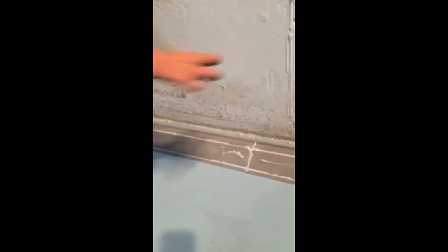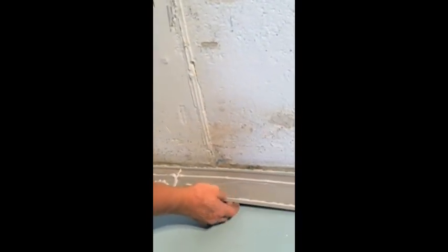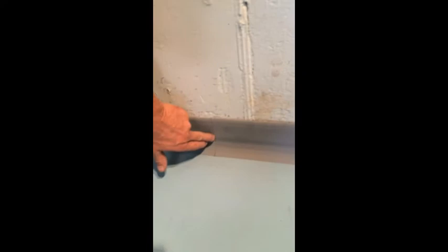Now, what I normally recommend with the Easycove adhesive is let it set up a little bit, because it'll start to tack up and it'll give you better initial grip. But for the sake of the video, and assuming that I have to get done right away, I'm now going to lift in this bonded piece together, and I'm going to put it on this wall like that. Okay? Now, this seam is still slightly apparent, but with our competitor's product, you've got to do this